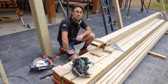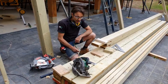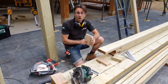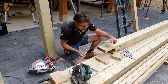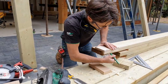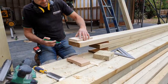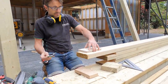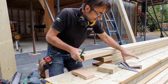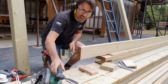I'm just doing some halving joints for some wall plates for this roof. When you're doing these halving joints, I always carry this little bit of ply — it's exactly half the thickness of the timber. It's just a matter of marking a shoulder, taking this block and running it all around the end. First I use it as a square on the shoulder there, then the first thing I do is cut it around the edge.